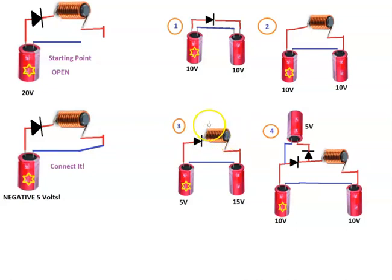Can we separate it and get 2 times the energy? Probably not. But we can separate it and get some, though there are going to be losses. Take a regular capacitor with 20 volts — no coil. Short that capacitor into itself. What happens? The capacitor goes to zero. You'll never get this capacitor to go to negative voltages. If you could, you'd have something special — it would mean you sent more out than it had. It goes to zero every time, until you put a coil in. Now it'll still go to zero with a coil by itself, because it's going to bounce and bounce until it dissipates everything — that's an LC tank circuit. How did it bounce if it only goes to zero? Because the coil is adding back EMF, bringing voltage from outside into the circuit, and it needs to do something with it, so it just peters it out. Now, if you put a diode there and connect it, you send 20 volts through to the other side; this side takes the 20 volts, so now it's zero. And the extra energy from this induction can't go back because it's blocked, so it's forced back through the coil into the negative side, and the negative side raises 5 volts.